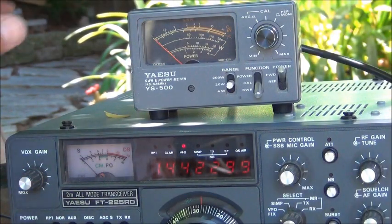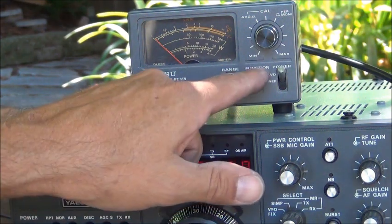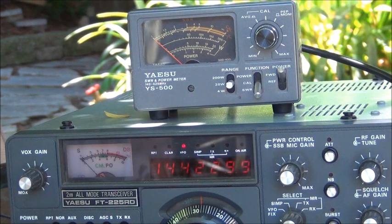Back to the SWR meter — I'll put it in calibrate again. Good. Let's put it back to SWR. It barely moved, so it's really in good adjustment now. Probably the next thing I'll do is make a longer piece of wire for the gamma tube adjustment so I have more capacitance available, and go from there.